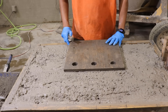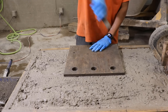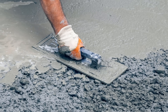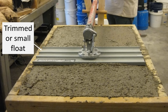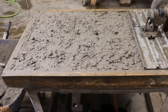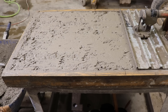The next step is to use a template and a dowel to create three one-inch diameter, one-inch deep holes in the concrete. Why do we make holes? When you strike concrete off, sometimes aggregates get plucked out, and it's the finisher's job to fill those holes — we need to measure that. Here's our float, trimmed so it only rides on the surface. We've got our rough surface with holes in it, and now we measure how many passes it takes to smooth it out and fill in those holes. The lower the number of passes, the better.